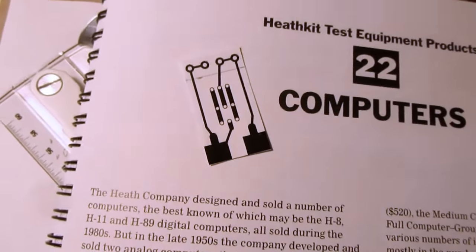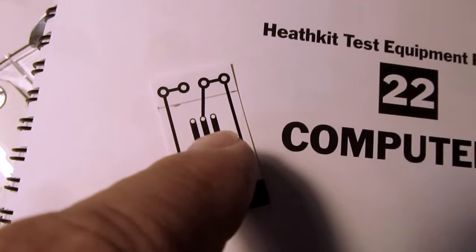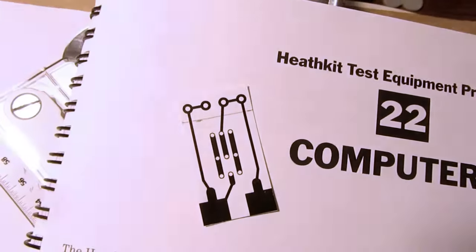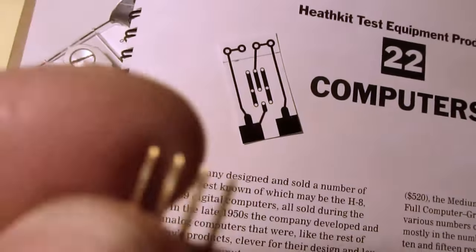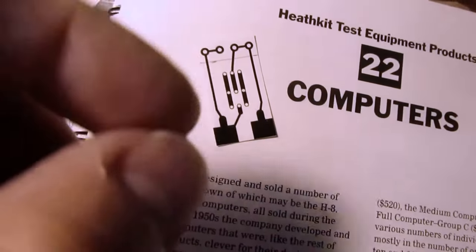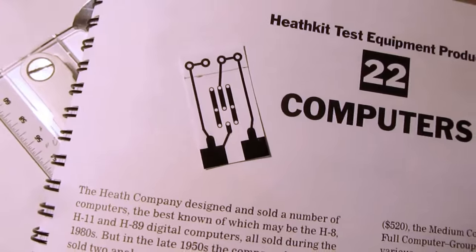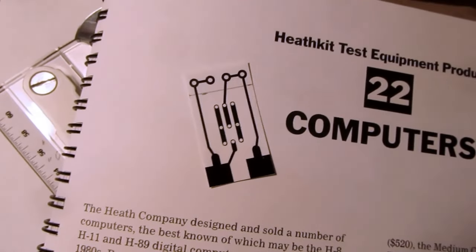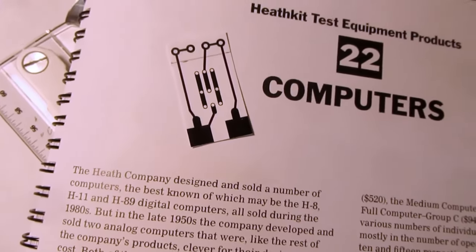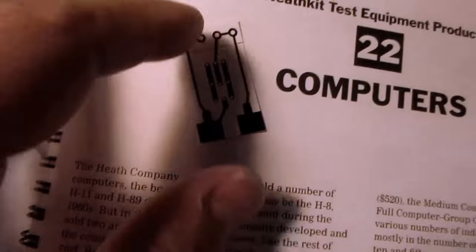I decided to go one step better, and I've got some little potentiometers that will go into these holes here. With the terminal removed, then the shaft will stick out in that direction and can be adjusted. And then using some little jumpers like this, I can put 2 3-pin shunt strips on there and then put the little plug-on shunts on them. And by doing that, I can program the pot to increase or decrease resistance on clockwise rotation, and so it'll have that flexibility.